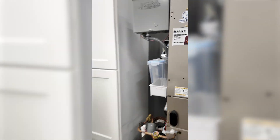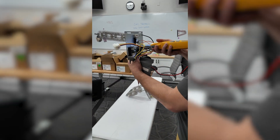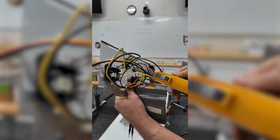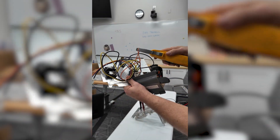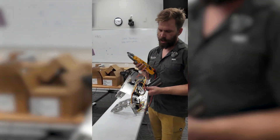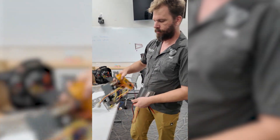If you're always testing straight at the connection pieces, they can be hard to get to and hard to get your meter out from. Sometimes you can pull your meter and accidentally pull the prongs off. If they're loose, you can bump something loose coming in. So that's another good reason to check at main incoming power for your heat kit amps.